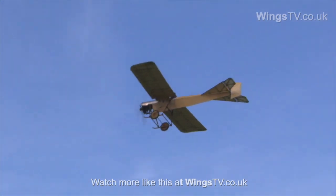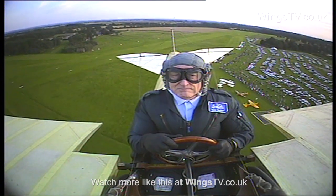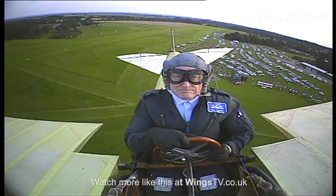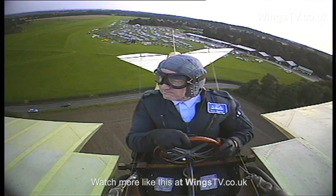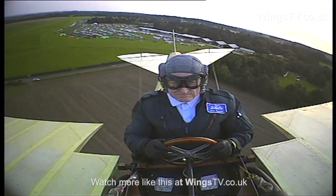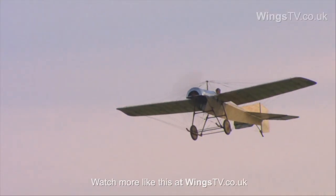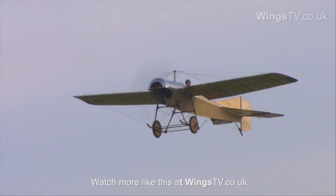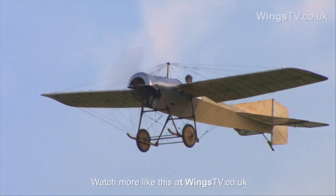The control system uses Blackburn's patent wheel control. Originally it was moved left and right for rudder, up and down for pitch, and rotated side to side for roll. Towards the latter end of his monoplane career, he moved the rudder bar to the floor for the rudders, blocked the control wheel in yaw, and it's just used to rotate for roll control and up and down for pitch.